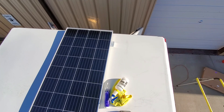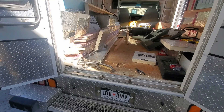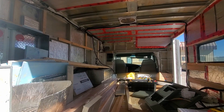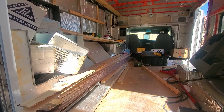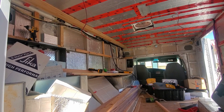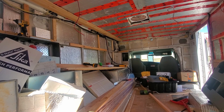That's a pretty close fit on the roof — almost as if I meant to do that. Goal for today is to get the ceiling up. I need to run a couple more wires for the fan and the ceiling lights and then we're good to start putting it up. Starting on the ceiling — it's definitely tough, not because of the wood itself but because of how it screws in and the little angles. It bows a bit because it's not a dead flat surface. You push too hard and it breaks; you don't push enough and it just takes forever.